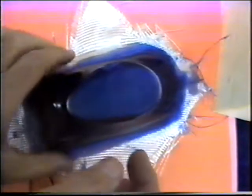Now, I guess for the first shot out of this mold, this is pretty decent. And if I wanted to, I actually could just patch this up. Maybe what I'll do is with some of the little resin that's left over, I'll make a little patch on that. And then I'll have a usable, actually, what this will be is a giveaway cowl to somebody. If there's anybody out there that wants a free cowling, it'll have a patch in it. But if you're building a Seafire or you just want to have one, you can have it for nothing.